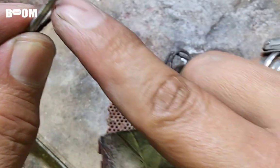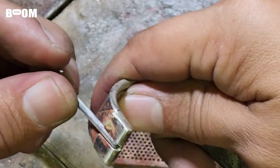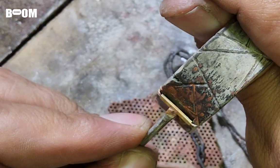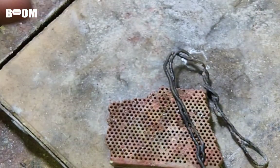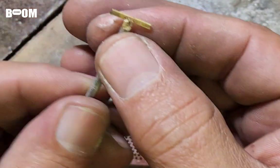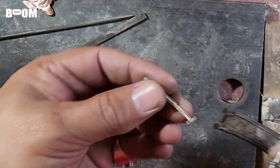Okay, whenever I hammered that to be flush with this, I hammered it kind of wide, because this side fits, but this side does not fit where I hammered it wide. So what I will do now is file right there and learn. I should have filed it flat earlier before I put the T on, but this is why you're watching this, so you know when it's your time to do this. I think some of this fine tuning is kind of valuable to share, friends.